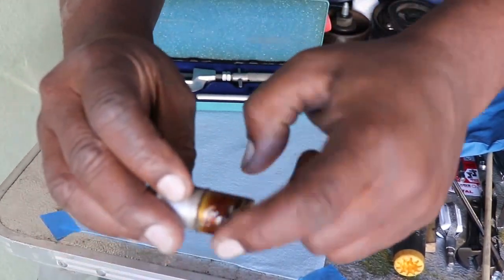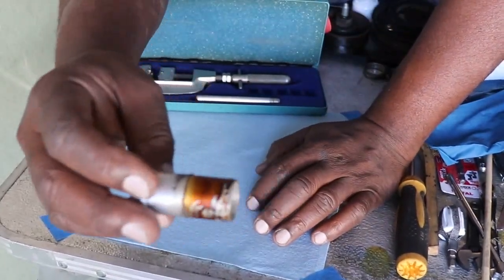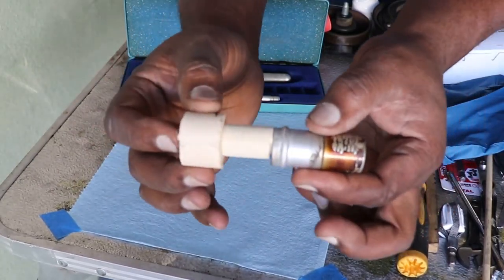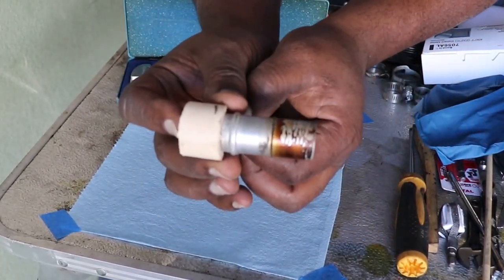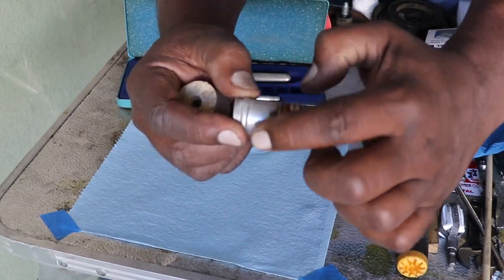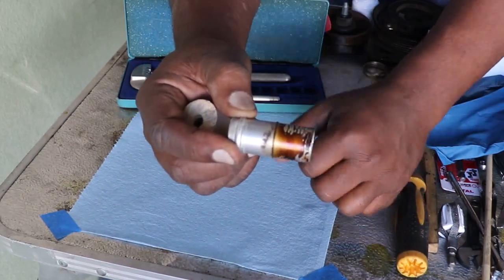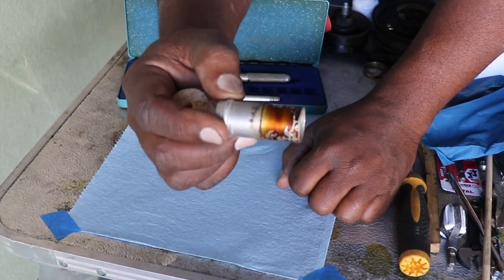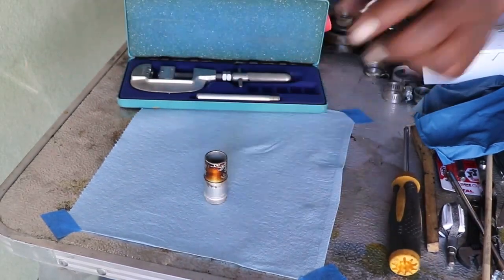And then we're going to put adhesive on this, we're going to put adhesive in the housing, and we're going to use our little tool that we made earlier to press that in. And then once this is in, I'll put another bead of the paste type adhesive around as a flange, since I can't really reach all the way back there to pin it. So let's get on with it.